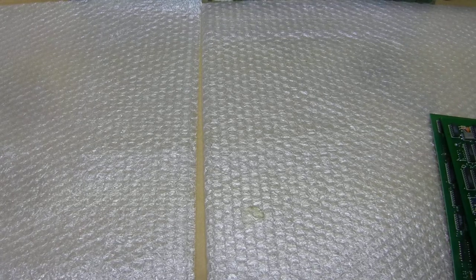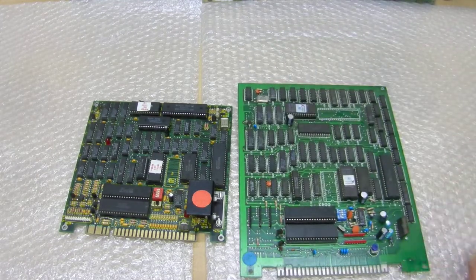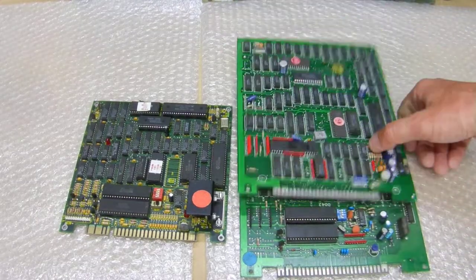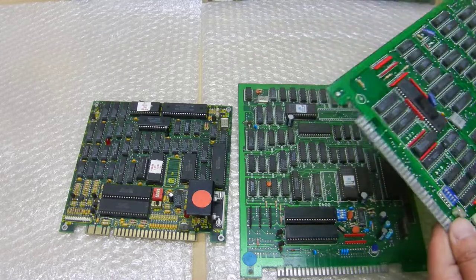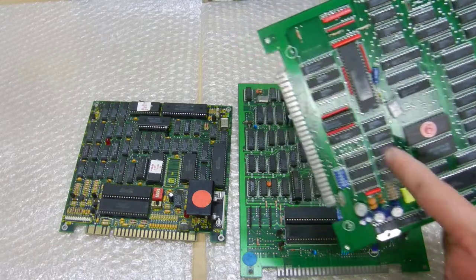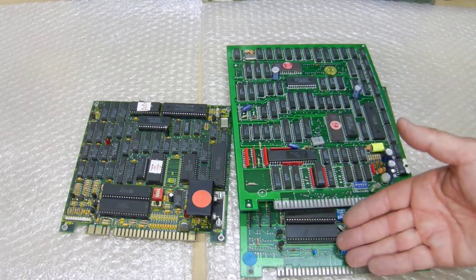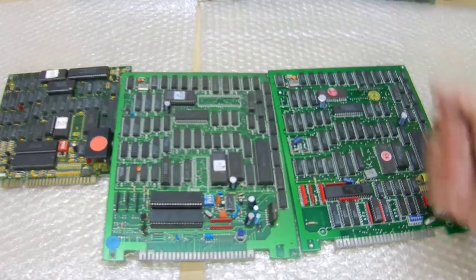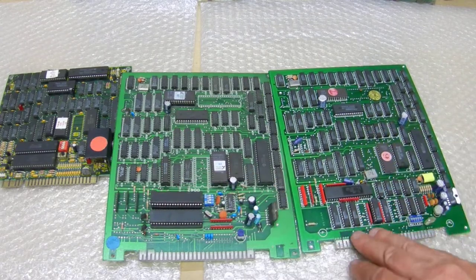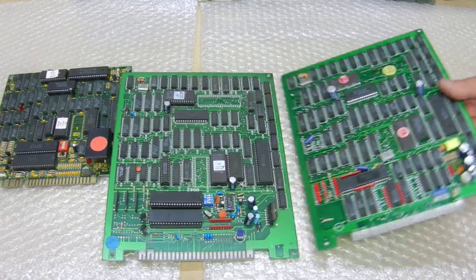Remember the original Tetris I showed you before? Here's another bootleg of it. This one's a bit better - they put TTL chips for the buffers instead of the two Pokey chips. When I got this board, the buffer chip - a 74LS240 - was blown for the inputs. This was easy to repair because it didn't have the Pokey chips like the original. Have a look - same boards, same everything, except instead of having the Pokey they just put TTL.